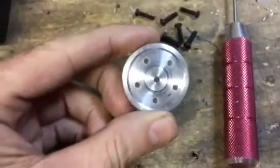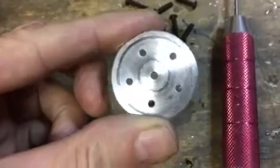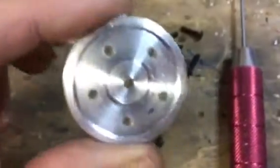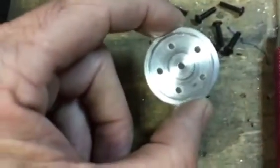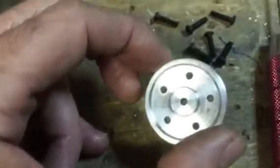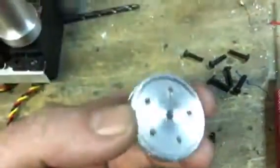And there's two. I'll do the rest of these off camera and then show you the pulley when I get it done. Here's the pulley — those are a number 40 drill bit, so they're about an eighth inch hole. Now I can put this back into the drill press vise if I want to enlarge those — they'd probably look a little bit better if they were just a little larger. I'm not sure whether it's better to do that or to drill them to final size right there as you're doing the DRO. It's not going to be a critical layout, nothing's going through — that's just for show. If you were doing an actual bolt circle to bolt two parts together, it might make a difference. But that's the Grizzly G0759 mill with the DRO and the bolt circle. Thanks for watching.